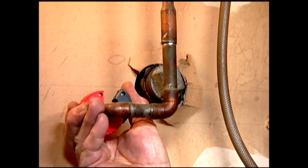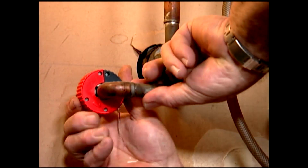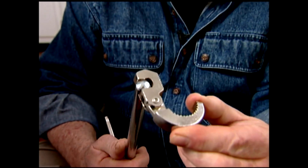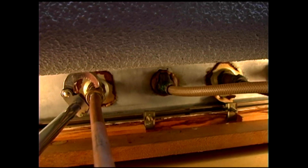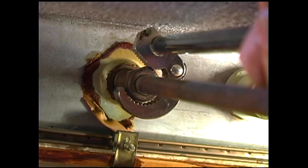I cut the copper water lines where they come out of the wall so that I can detach the lines from the faucet. This is also where I'll install the shut-off valves so that from now on, the sink water supply can be turned off without affecting the rest of the house. My next step is to unscrew those water lines from the faucet, and that's where I find this tool to be indispensable — it's called a basin wrench, designed just for this purpose: to reach up behind the sink, grab that nut in these jaws, and loosen it. You can see how impossible it would be to get a conventional wrench in here. I use the tool in a ratcheting motion, backing off the nut a fraction of a turn at a time until I can remove it with my fingers.